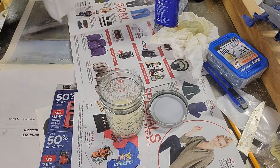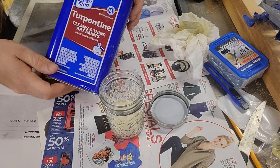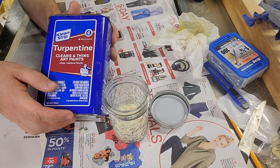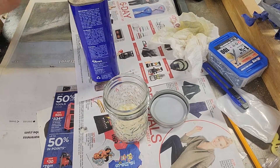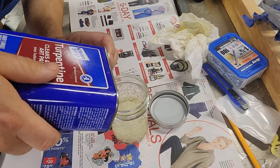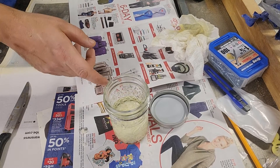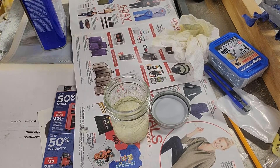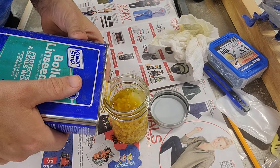Right about there. I like to use turpentine because I've discovered that turpentine doesn't separate like mineral spirits might — I've had various luck with mineral spirits over the years. I have a knife in my hand just because I like to pry the top off. I'll fill that up to the two-thirds mark. So a third of beeswax, a third of turpentine, and now the final magic ingredient is boiled linseed oil, which I'll fill up the rest of the way.